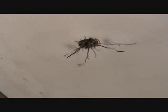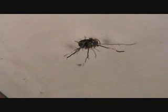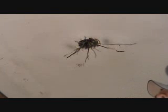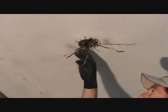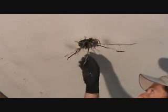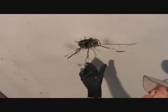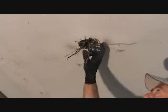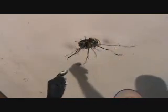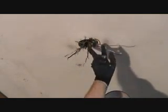Okay, now at this point, I'm going to turn the breaker back on. Okay, I've got the breaker back on. Now, basically I'm testing now what I want to find out which set of wires goes over to the electrical panel. At this point, I don't care about the light switch, do I? Because one set of these wires goes over to the light switch, one set of wires goes over to the light, and at this point, there's one light that was above the kitchen sink.